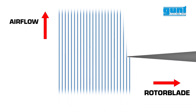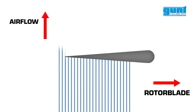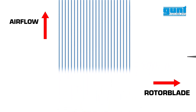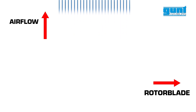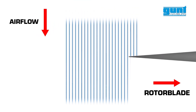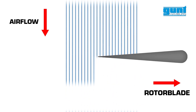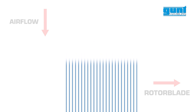When the air comes from below it's pushed to the left and drives the blade to the right. And because the axis is horizontal, the same happens when the air comes from above. So regardless of whether the air is coming from below or from above, the Wells turbine turns in one direction only.